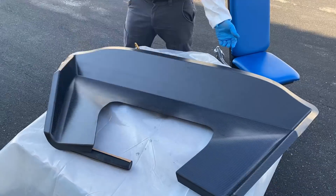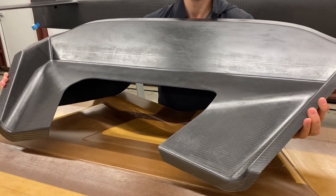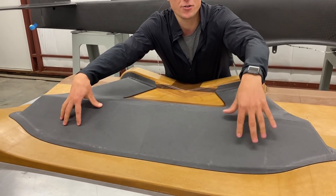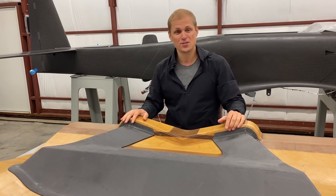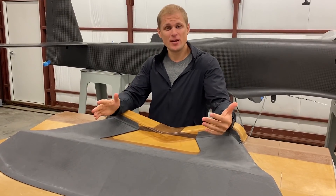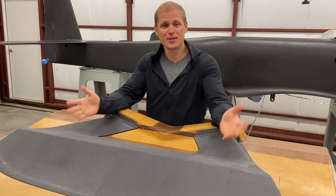Let's take a look at the inside of the part. As the part sits right now, it's about four and a half pounds. We're not fully finished yet — there are some access holes we have to cut in here, placed on this face of the part, so we can reach through and get to the motors that retract the main gear. Just recapping: this is the biggest MDF mold we ever made. We did have some concerns with dimensional stability issues and quirks associated with MDF, but we got away with it. We have a few more parts in the main gear that we still need to make before we can tile this together and install the main gear in the fuselage. We'll show that in subsequent videos, so be sure to follow our channel to see that progress. Thanks for watching — we'll catch you next time.